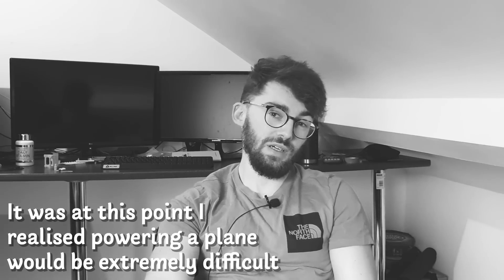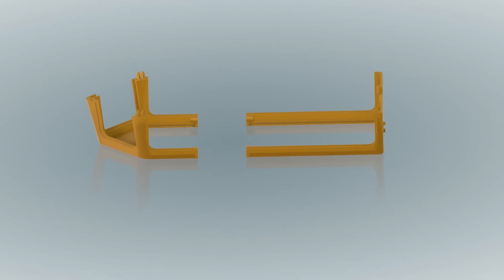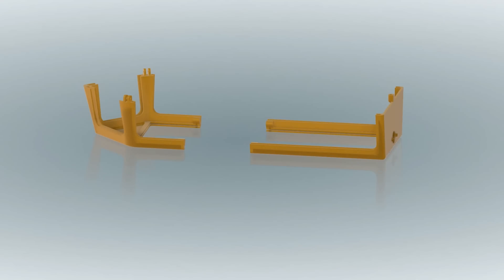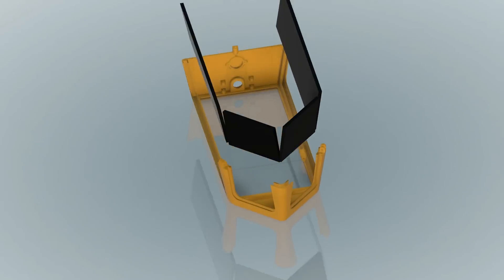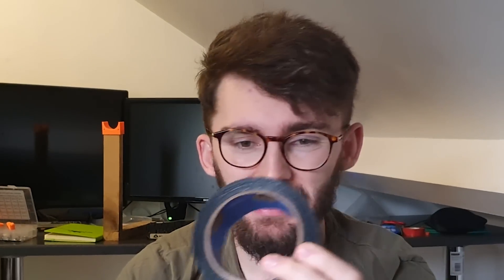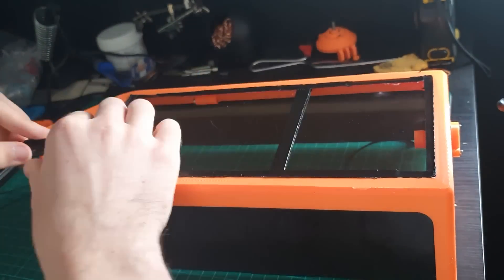I don't think this is going to be powerful enough for a plane, so I'm going to pivot and try and power a boat instead. I didn't want to redesign the entire engine, so I tried to design a hull which I could attach the engine to. I've designed this hull that needs to be printed in two parts, mainly because my 3D printer isn't big enough to print it in one go. The bottom of the hull will be two acrylic sheets which I will join together, and the sides of the hull will be made from some foam board. Because there are several joins, chances are it's not going to be watertight, so I'm going to use all-weather tape around the joins to seal it. I could use glue, but the commitment scares me.